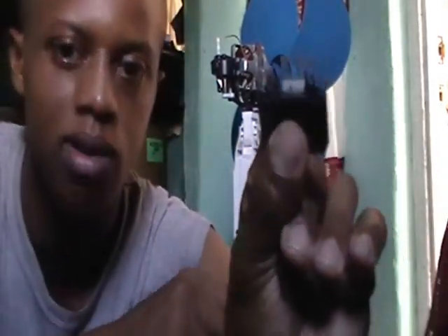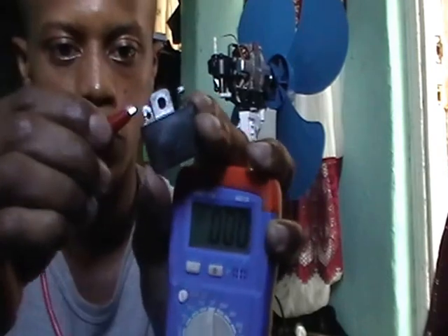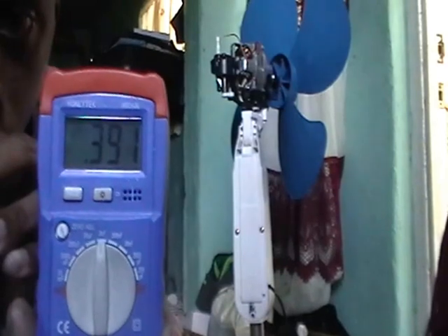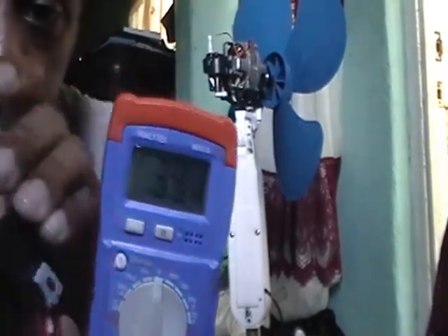You need a special multimeter that can do this sort of test, or a capacitance meter. I have a multimeter that can do capacitance, but I also have my capacitance meter nearby, so I'm going to use that. I'm going to set it to two microfarads, place one lead here and the other lead there, and test for capacitance. It should read 1.5, but if you look carefully, it's saying 0.391. So this is what I was talking about — the capacitance is very low, well below the five percent tolerance we saw on the label.